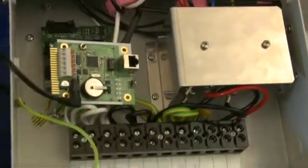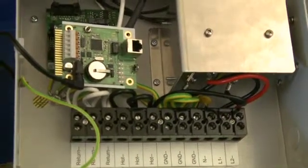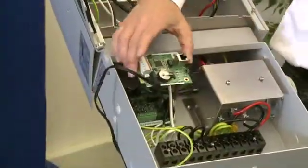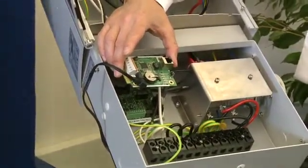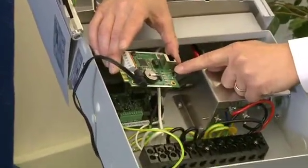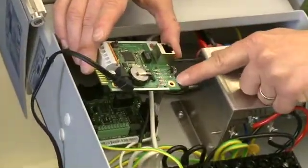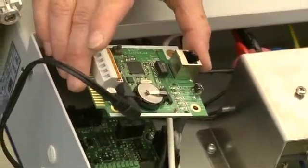Once the card is started, we can do a little testing and then some troubleshooting. Now you can see that the card is doing a single blinking — that's the COM light. The link light is not on, the ACT light is not doing anything, and the COM light is blinking three times. That actually means communication is pending.